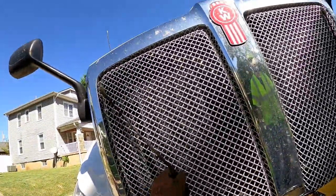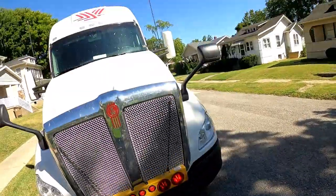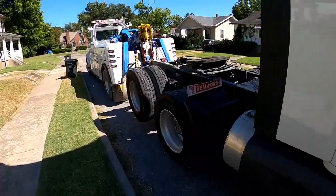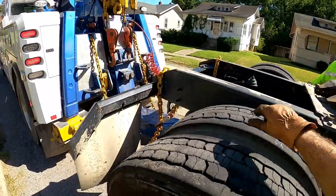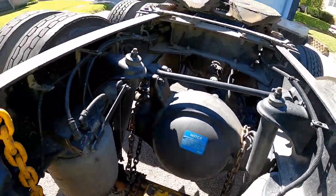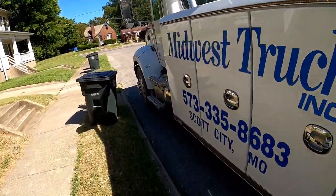All right. Turn it on. It goes through its systems check. All right, then you do a walk around, make sure everything's good and solid. And we'll check the lights on the bar, since you're here with me. Make sure those are good. Make sure the U-bolt cups are seated, our chains are all in place, tie downs and breakaways. We should be good to go. If you want to watch the back, I'll turn the turn signals on and hit the brakes. Make sure that they're working right.